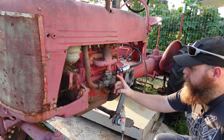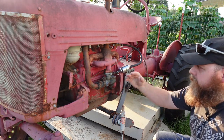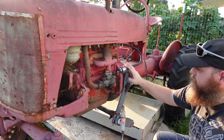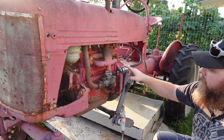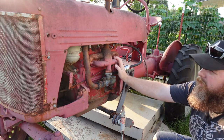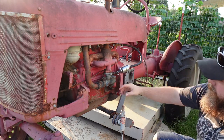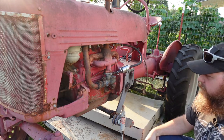The Cubs do come with a carburetor. Early models have an International Harvester-built carburetor; later models used a Zenith carburetor. Normally there is a fuel bowl, but the person I bought this from just ran it direct into a fuel filter. A lot of people will use the bowl, come out of the pipe into a fuel filter, and then into the carburetor. From there it goes up into the exhaust manifold and out the top into a vertical top stack. Later versions of the Cub do not have a vertical exhaust — they actually come down and out the back end for a lower exhaust. You also have your oil dipstick here so you can check the oil level in the engine.